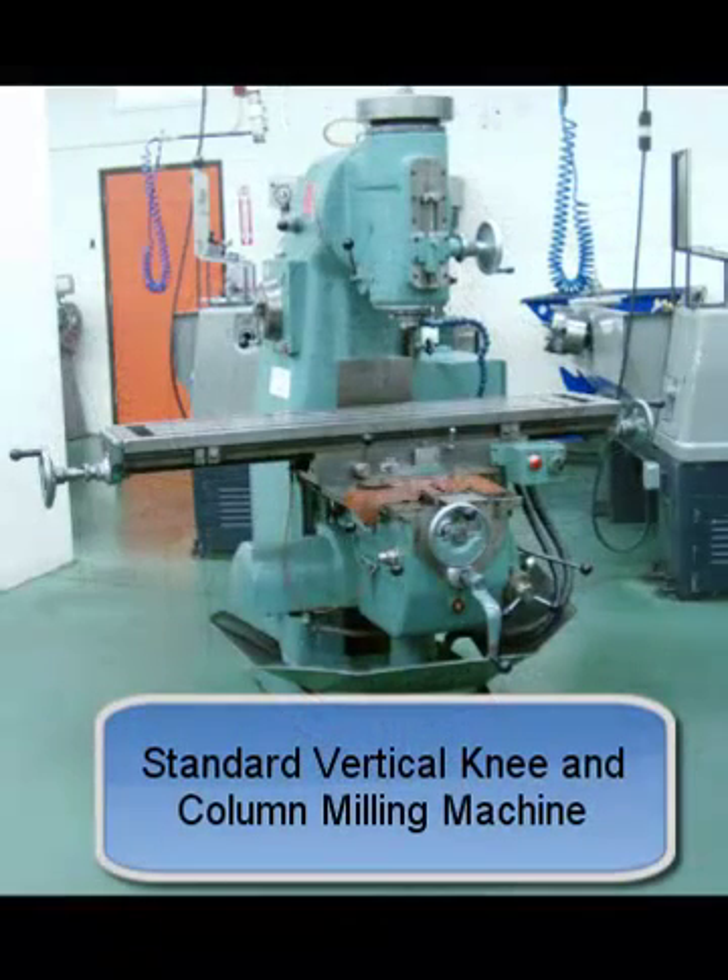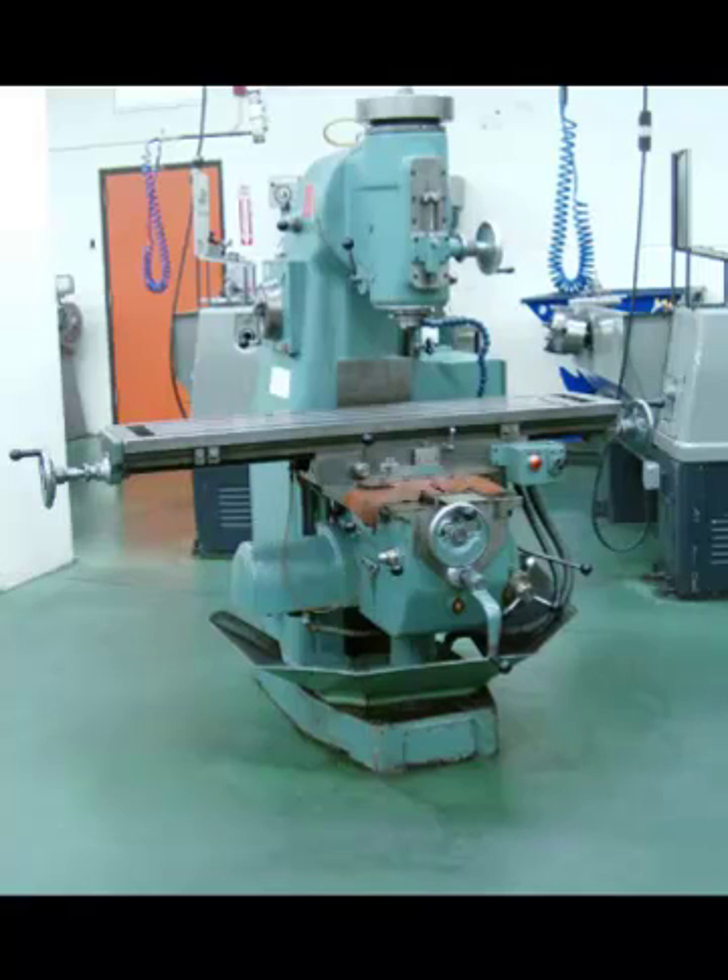This is a standard vertical milling machine and although it is similar to the ram type vertical milling machine, this one is more suitable for heavier types of work. It will likely have power feeds and rapids on most or all of the axes, whereas the ram type vertical likely will not unless added. The difference is this one does not have a ram on top of the column, and the spindle takes a standard milling machine taper, typically with a C style arbor — meaning the arbor has a cutter on the end and will be quite short in length.